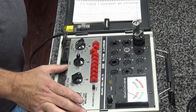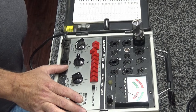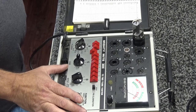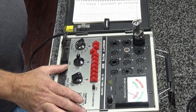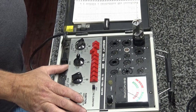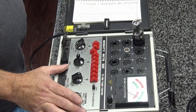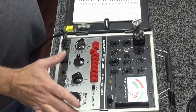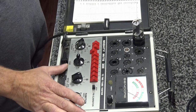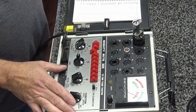Where that comes into play is on old televisions and stuff like this out in the country that a lot of people have. They're subject to old poor power lines, and maybe their line voltage ain't 118, 120. It might be more in the order of 105, something like that. So a lot of times I've had TV sets and radios come in that they said didn't work when they were at home, but when it comes into the shop, it worked fine. But that's because the shop had a higher voltage. So what you would do is plug your TV or your radio into a variac, and you would reduce the voltage of the set just a few volts, and then you would see the problem. A lot of times it would go from working fine to not working. And then you would just determine which tube you think it was, put it in the tube tester, and use this life test, and you would find what the problem was.